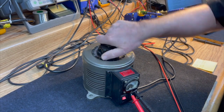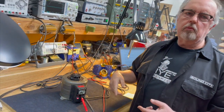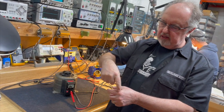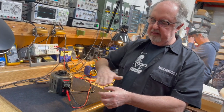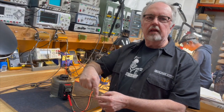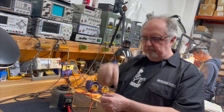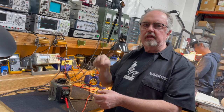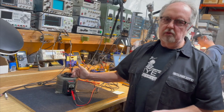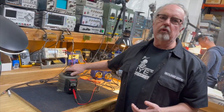So it's a real crude device. It's just a coil of wire wrapped around an insulator. And then it has a contact, where all the wire on the top of the insulator is bare, so the contact can touch each turn of wire. And then it just picks off the voltage at any point there. That totally makes sense. So all we need for the winding to do is to be able to handle whatever current we're going to pull through it at whatever setting we're operating at.